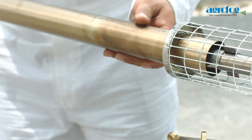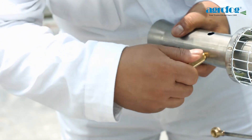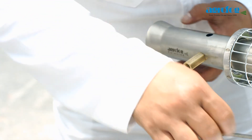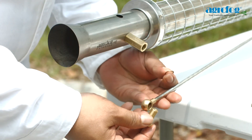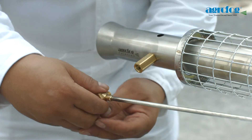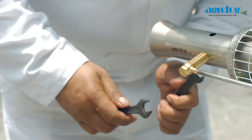While preparing the unit for next use, firstly tighten the fog solution socket screw by hand and join the solution dosage nozzle to the solution tube by connecting it with the hollow screw. Always ensure that the solution line ring piece is between the two copper gaskets. It is important to hold a second spanner against the fog solution socket.